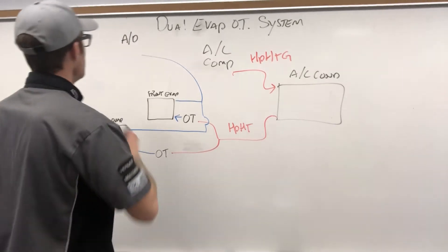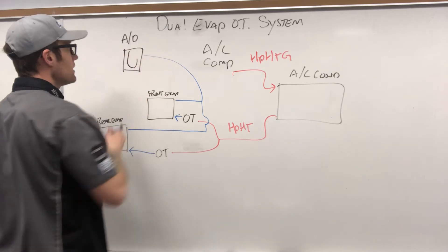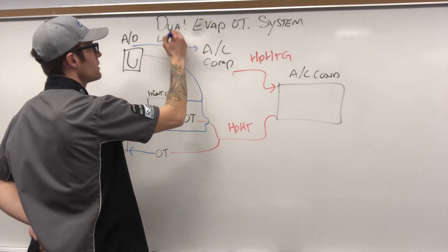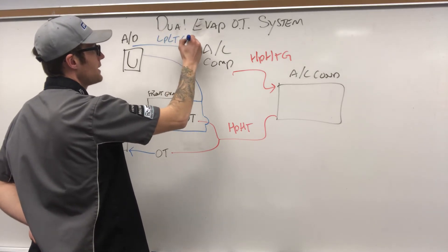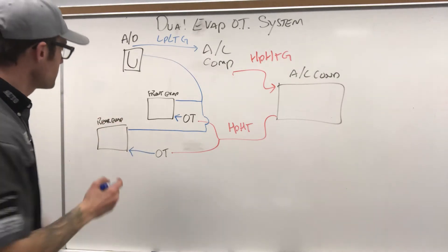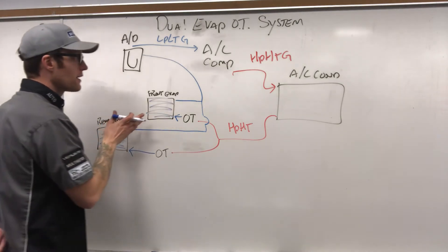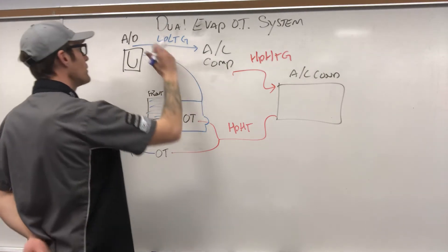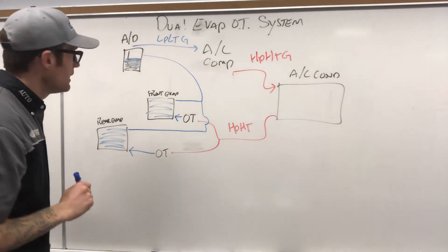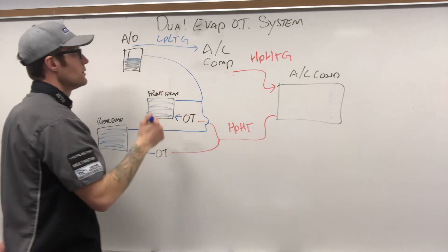From the accumulator dryer, any excess liquid will drop off into this thing. There's actually a little J-loop pickup for the compressor that will draw back our low pressure, low temperature gas. Like I said in the first orifice tube video, we might have a situation where we flood the evaporator. If we flood these, the compressor, basically when it's pulling, is going to pull that liquid into this can — so this can might be half full of liquid. In that case, it will pick up refrigerant off the top of the can and go back to the compressor.